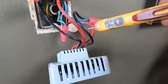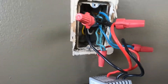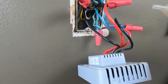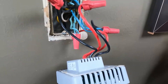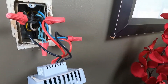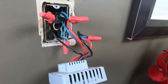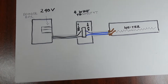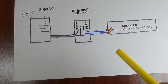In another scenario: you have power coming in and going out of the thermostat, so the thermostat is good, but you still don't have heat. In that case it's either the wiring going to the heater or the heater itself. Let's go to the heater and find out.